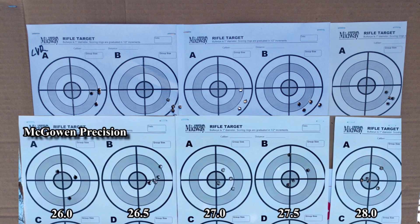Here's what I think is very interesting, and I know the bore is true because of this. With both these load developments, when you take a look at the minimum charge — 26 grains — when we go up to 26.5, we note that both groups at 26.5 show a huge shift to the right from the previous group, and then the point of impact roughly stays about the same place if you discount the flyers. Again, that's evidence that the bore was true.